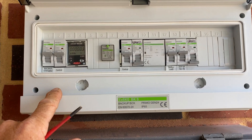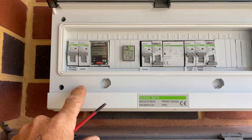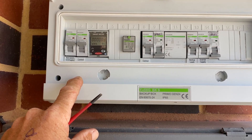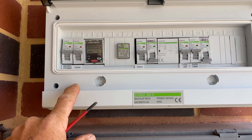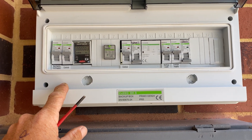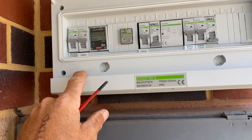There is a small break in power with the Fronius setup of up to 15 seconds before the backup kicks in. If there is a grid outage it takes about 15 seconds for the power to come back on in off-grid backup mode. It can run off-grid indefinitely, so if you've got a long power outage you can pretty much remain off-grid indefinitely. Obviously you need to watch that you don't deplete your battery completely, otherwise you will still lose power at night.